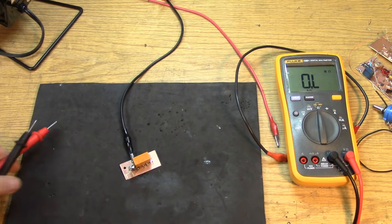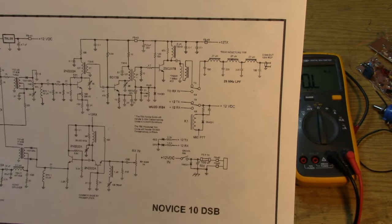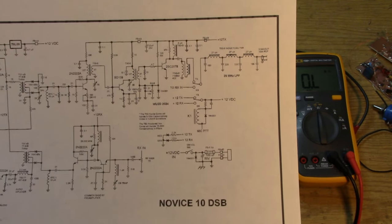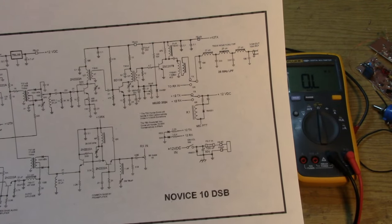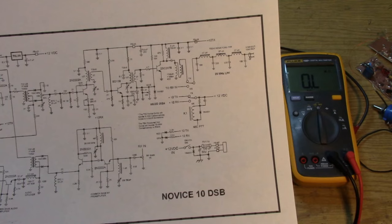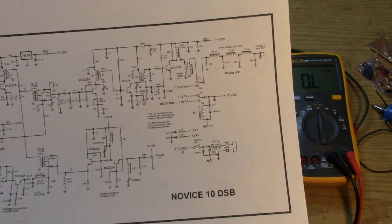So I'm going to make a keep-alive circuit. It's kind of a current-saving circuit consisting of an RC that we basically put in series with the relay. You see, it's this little RC that we have, and that goes up to the voltage at the top of the relay. Of course, we have our reverse spike protection diode there, but the PTT is going to ground the bottom of the coil and the relay will actuate. If I size the RC properly, I should be able to save some of that current. So instead of drawing the full 15 milliamps, I might be able to cut that current down. And the way that happens is the capacitor looks like an instantaneous short circuit, so you get the full voltage applied. But once the capacitor charges up, now the resistor comes in line and it saves some current.